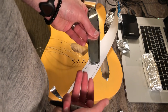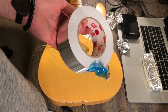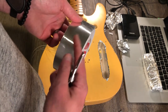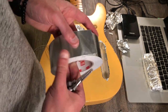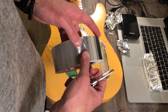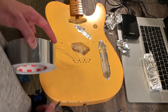By the way, this tape is from Harbor Freight — not expensive. It is conductive with continuity throughout, except the adhesive is either not conductive or very weak, so I wouldn't trust it. If you stick a piece on top of another piece that's not connected already, you won't have a continuous electrical connection. An easy workaround is to turn a piece of tape over, connect the two pieces, and then put a piece of tape on top of that — just keep track of where you need a connection.